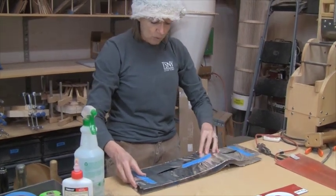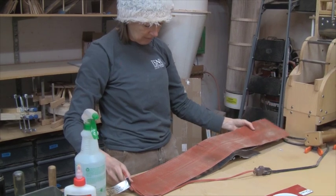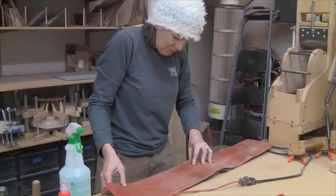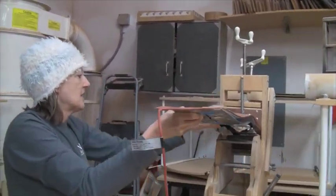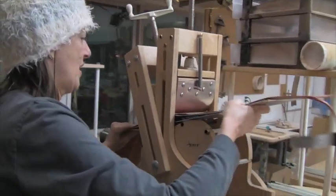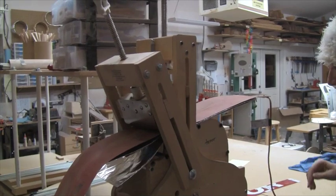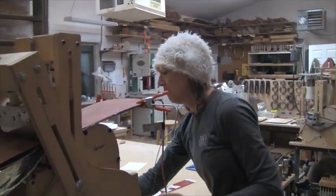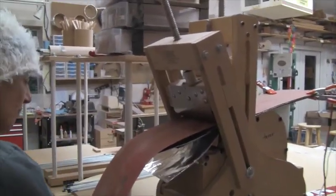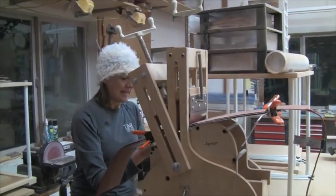I'm going to line this up here — got my waist mark right here. I'll get my heating blanket. I also have a waist mark on my heating blanket and I'm going to put that into the jig here. There's my waist mark right there. Push that down enough to hold it in. I'm not going to turn on the heating blanket yet — I'm just going to get the whole thing set up first. So I put my thermometer in, then clamp it all together. It's very important to have it clamped so that I get even heating when I do turn it on.